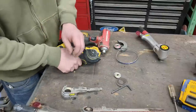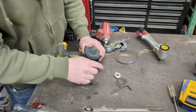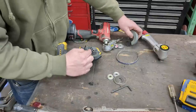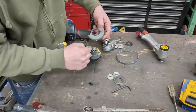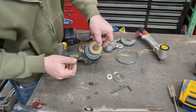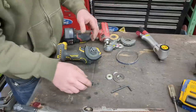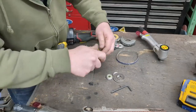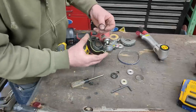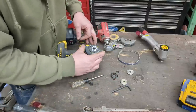On the DeWalt, I've never done this before — I built the complete assembly for the Milwaukee. The first thing I had to do, even for the first modification, was widen this out a little bit. DeWalt decided to make this little cutout a little bit smaller than the Milwaukee, so you couldn't get the larger blades in there — they were just a little too tight, so I just ground that down a little bit. All we've got to do is remove the backing plate — just remove four little Torx bolts. There's a spring washer in there to add tension and some detents to help it lock in different positions.